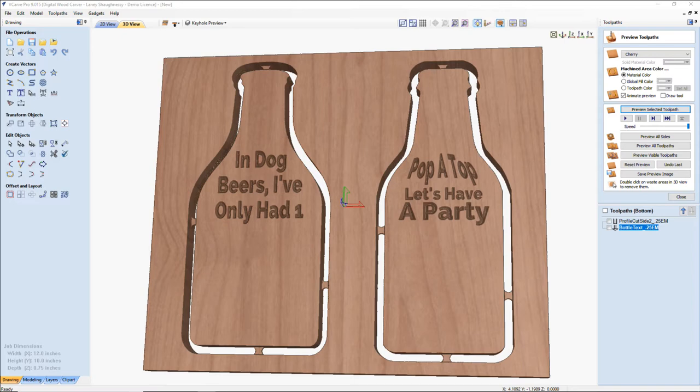I cut my pinholes quarter inch in the main piece, and when I move the piece, I put a quarter inch in the wasteboard. Yes, Dennis, exactly. It's the same process, and by doing a quarter and quarter, you make sure your pins are less than half an inch, because when you push that board down on those pinholes, you don't want the pins keeping it from laying flat. So you just make sure the pins you're using are smaller than that combined half inch depth. So exactly right.